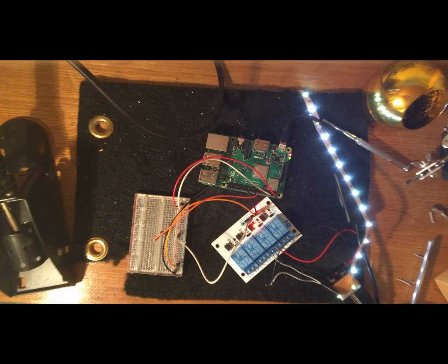And I can flash them. So that means when we actually have the circuit running and we plug the input 2 wire into the GPIO pin on the Raspberry Pi, by turning on the GPIO pin, we turn on the lights, and by turning off the GPIO pin, we turn off the lights. So that's it for this setup video, and then next we'll be going over code, and then we need to do the water sensor, and then we can bring it all together and get our hydroponics to work.